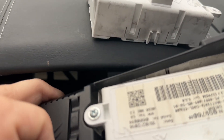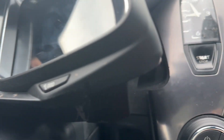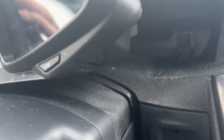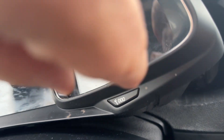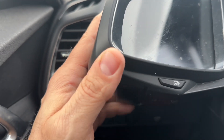Screwing this back in, you can use Phillips head screws instead of the hex key — they're exactly the same thread. There's actually a channel here where you push in the screwdriver, unfortunately not visible when it's mounted inside. It's about 1.5 centimeters from the edge, or a centimeter from this point — about half an inch. And here also about half an inch from the edge of this button.